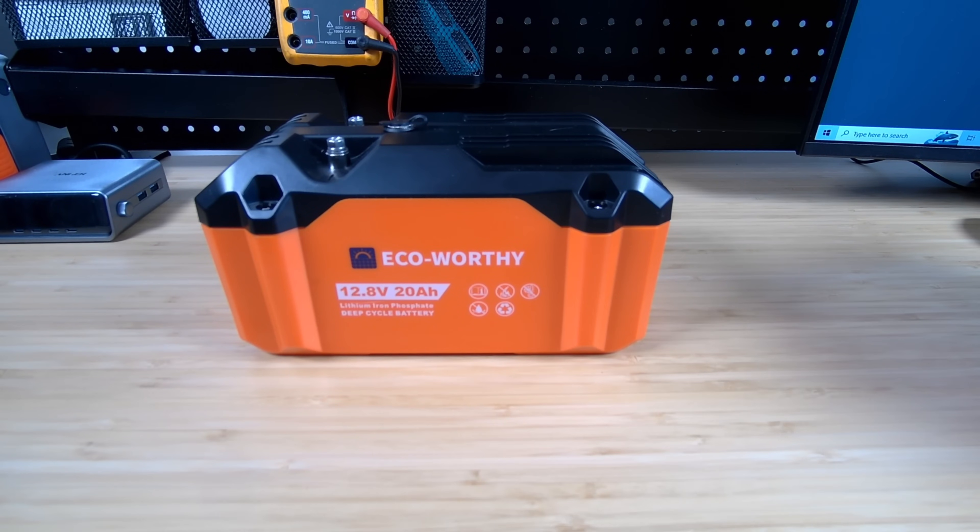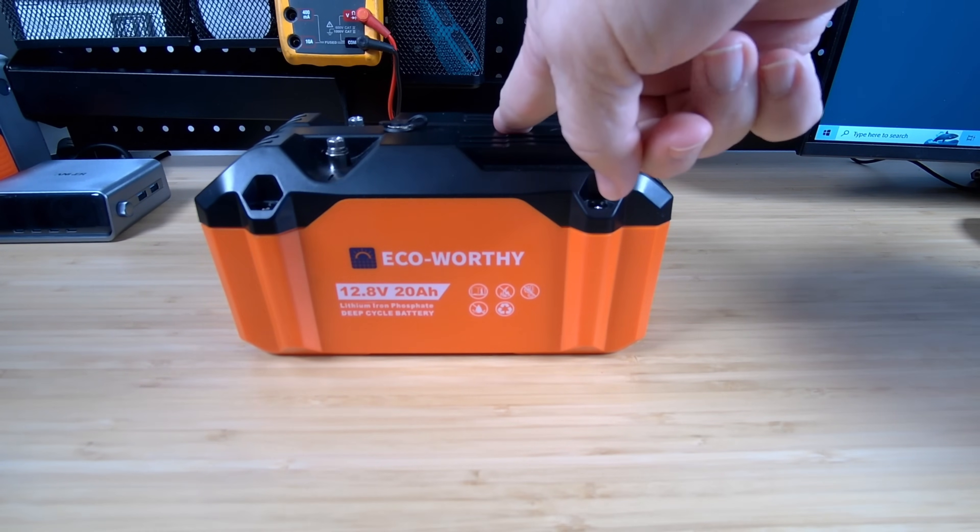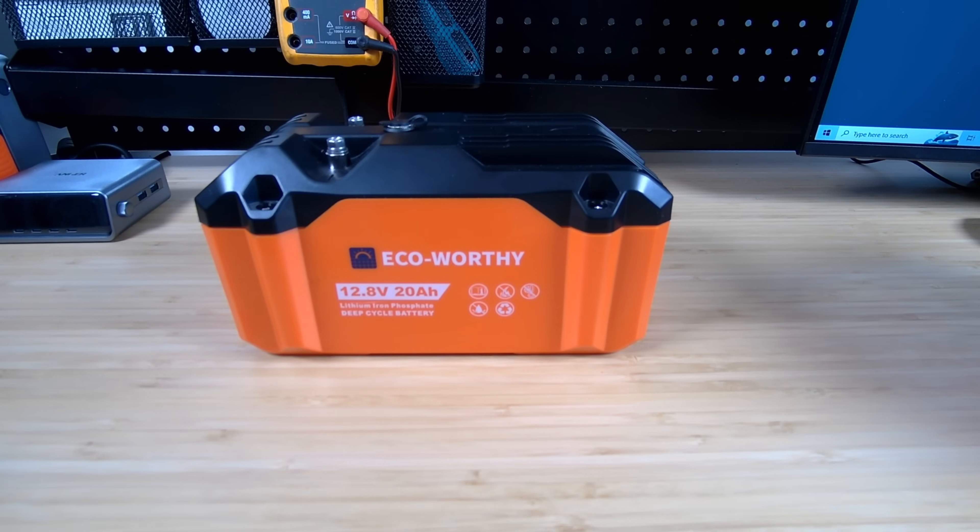The theory worked out — I was able to use this battery to charge, or recharge, or extend the battery life of a power station. Now one downside of this configuration versus just buying the EcoFlow battery is that the EcoFlow products know how to charge each other. That extended battery on any EcoFlow product will actually charge through the power station. In the configuration I did here, it was not charging this external battery when I plugged the station into the wall, so we need some other way of charging it.